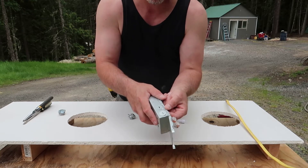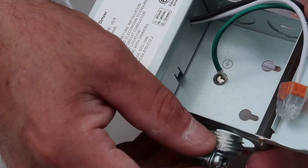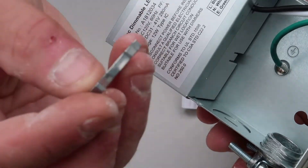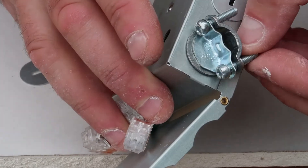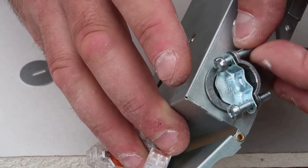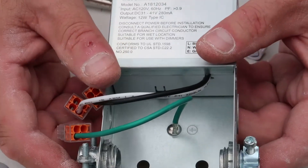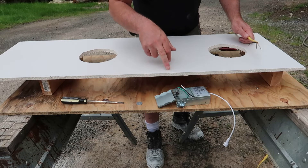If this is your first box in the series, you're going to knock out two of these. Once you've got that popped out, take your clamp and just put it in the hole like that. Take your little washer nut and screw it on. They're usually loose enough to back off by hand which is a little quicker. Doing this step first makes your life a little simpler — now this box is ready.